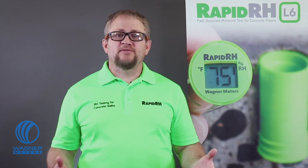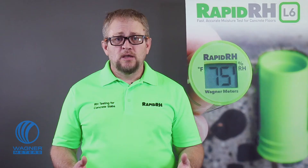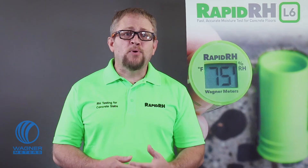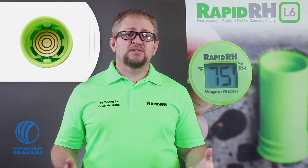Lastly, I'm bringing up an F2170 requirement that can have nasty consequences if overlooked. The F2170 standard states that you must perform three tests for the first thousand square feet and one test for each additional thousand square feet after that. The reason is that such a large surface area of concrete may have irregular moisture conditions due to a variety of reasons, from irregular pour time to differing concentrations of aggregate. The point here is you will want to strictly adhere to this standard requirement unless you want to risk flooring failure. My best practice advice here is to err on the side of caution. Follow the standard, but if you have reason to suspect other areas of the floor, our little L6 sensor weighs about an ounce and you know what they say about an ounce of prevention.